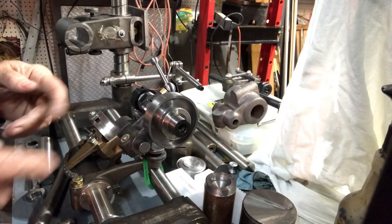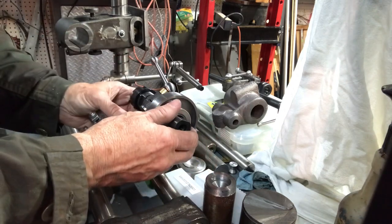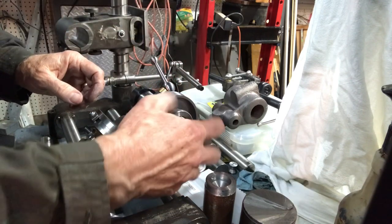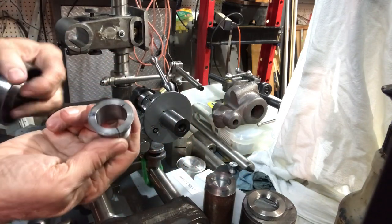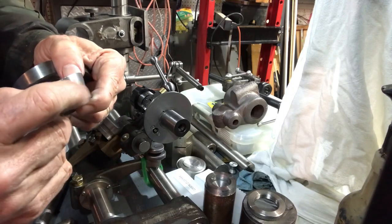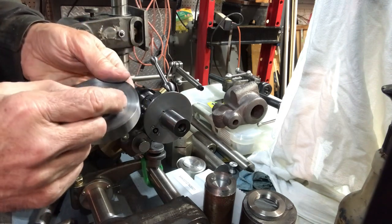Using three slits worked out really well. My whole objective was to be able to tighten this by hand and still be able to rotate the spindle - and to loosen it by hand so it disengages. I didn't want to have to use a spanner. Here's the collet with the three slits: the main one was cut with the slitting saw, the other two I did on the bandsaw. One I got a little carried away and actually went through the threads, but I stopped short before cutting it all the way out. The other I made a groove and enhanced it with the hacksaw. Mission accomplished.